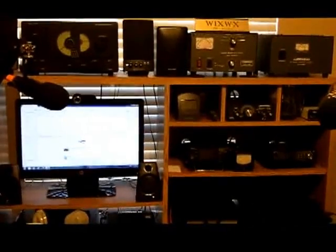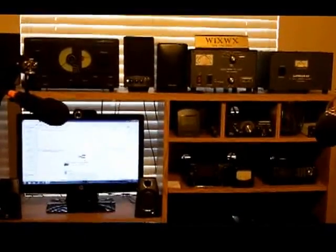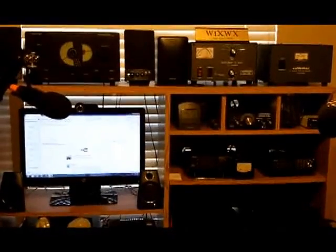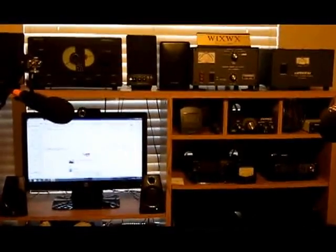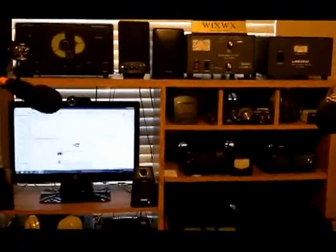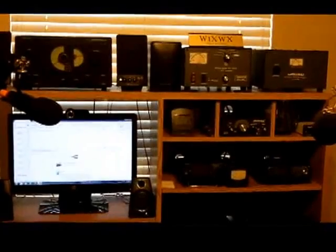Seems to have worked. I don't have any RFI in the shack even when I run the amplifier or anything else. The computer doesn't shut off, the USB ports don't disconnect, nothing happens. I get no RFI back into the microphones or anything like that. So the ground system seems to be working very well. By the way, I'm using either half-inch braid or one-inch braid — the main one outside was one-inch braid. Anyway, have a great day. I wish you clear skies and 73. Remember to keep looking up to see the greatest show on Earth right over your head every single night. See y'all later.